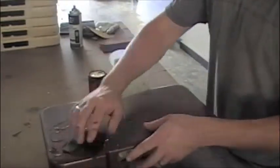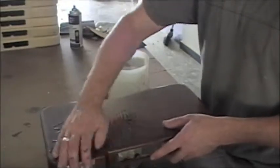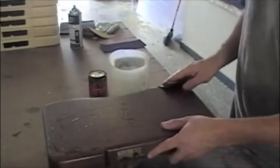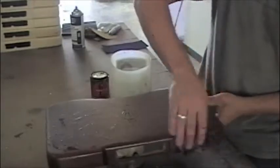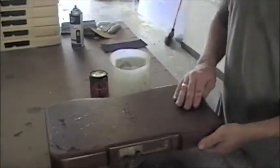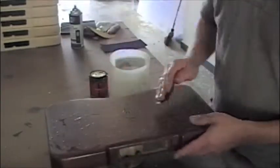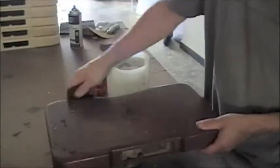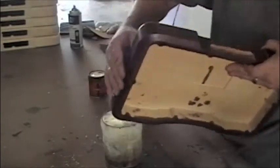You want to be very careful on the edges. Try not to sand straight on. Try to cup your hand and go very quickly on the edges because the sandpaper will remove material quickly and take it down to the wood, and then you'll have to stain and re-lacquer. Really I'm just wiping it down with wet dry paper and standing it up on end to sand the edges.